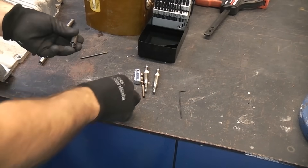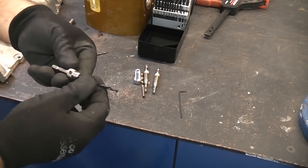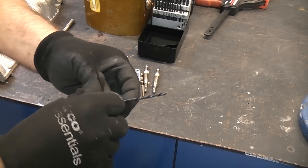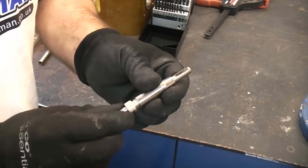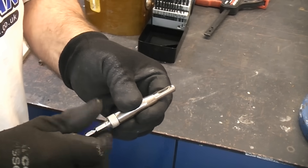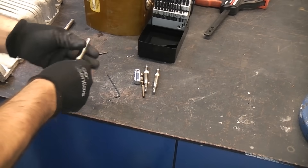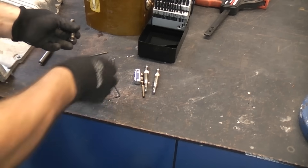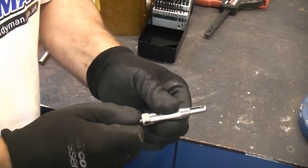For the first bolt I'm going to swap the drill bit over and use a left-handed drill bit. I'll push that in, tighten the grub screw, and screw that back together. The actual drill bit I'm using is a bit shorter than the one I've taken out, so I'm just going to remove the spring — that will still centre the drill bit.